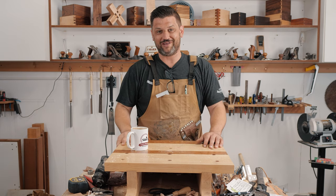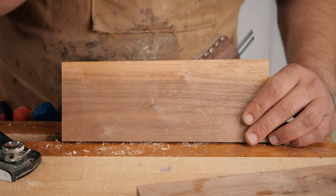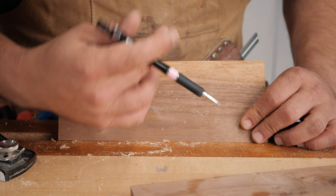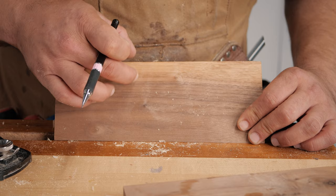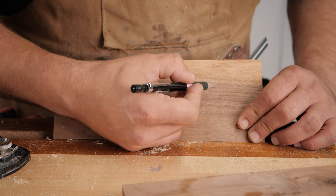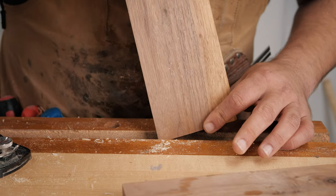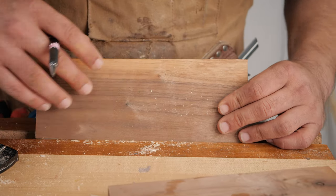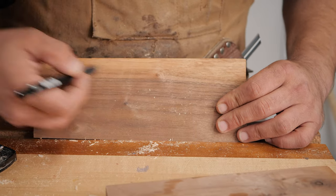Let's come on into the bench and I'll show you with a hand plane. Very quick review in case you haven't seen any of my hand plane videos. When you are planing a piece of wood along the long grain, you want to look at the wood grain — this is a great sample piece because it has sapwood. You can see the grain goes up this way, so the tree was actually growing this way. You always want to plane this way. The metaphor is: pet with the hair of the cat, not against it.